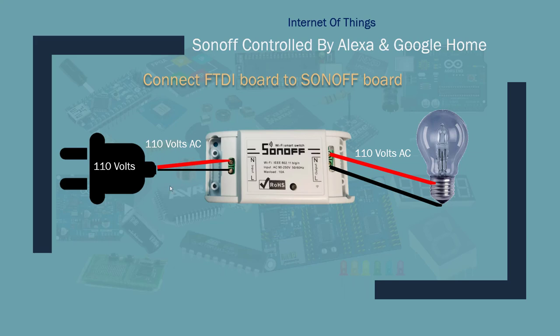From your plug you'll have two wires. If there's a ground wire, it goes directly to the ground of your device — you don't need to do anything else with that. Just cut your hot wire and your neutral. Preferably you want to put the hot wire on the one controlled by the relay. For this demonstration the red hot wire goes into this connector and the black neutral goes in here. On the output side you connect whatever device you have — it's AC voltage, very simple.